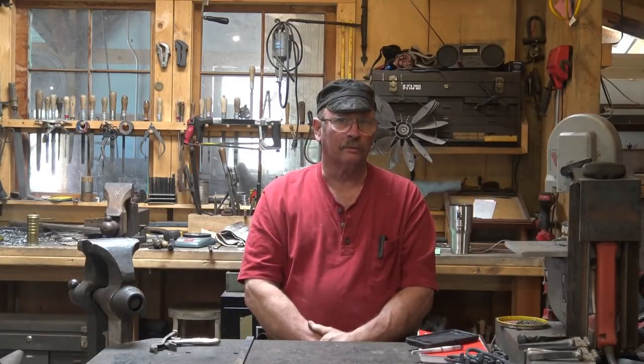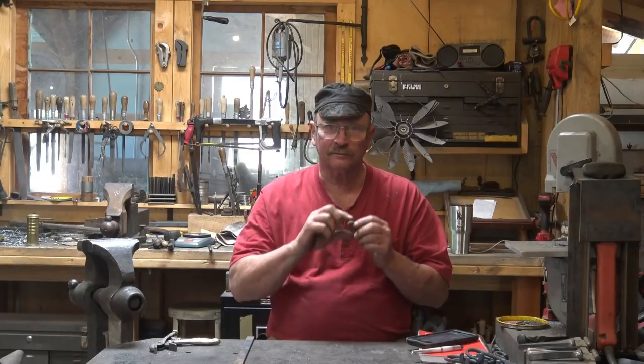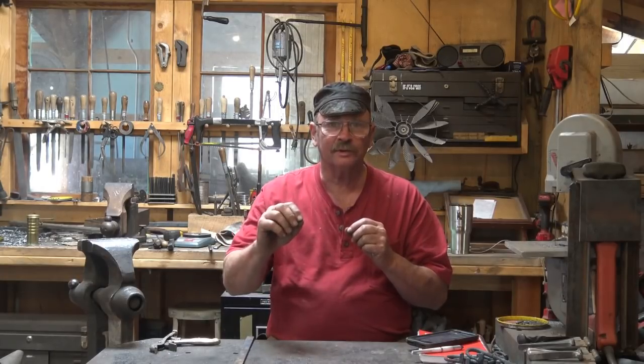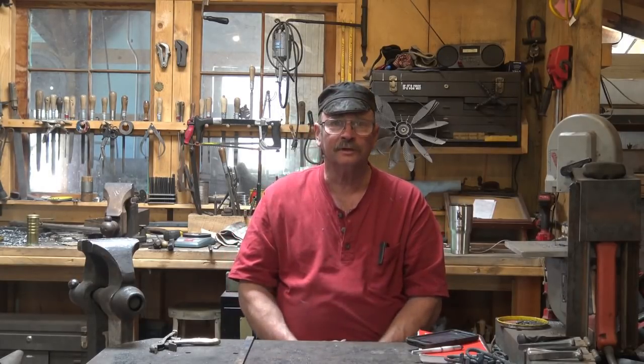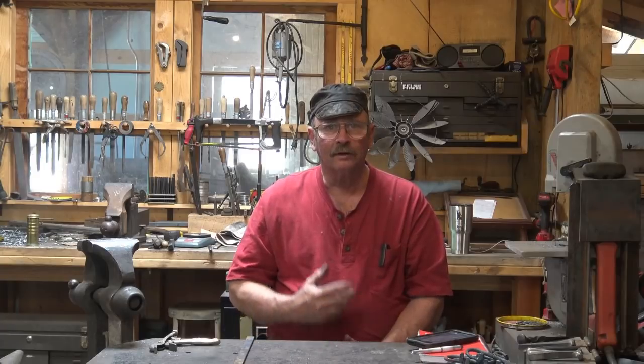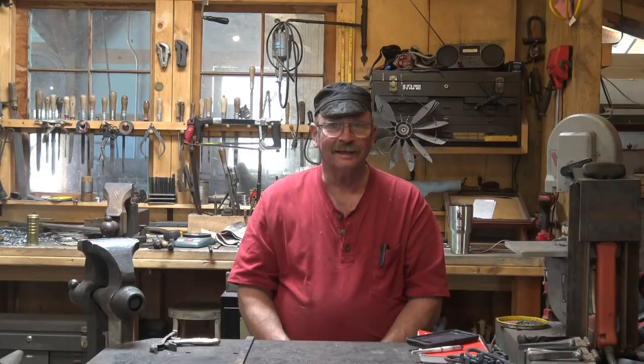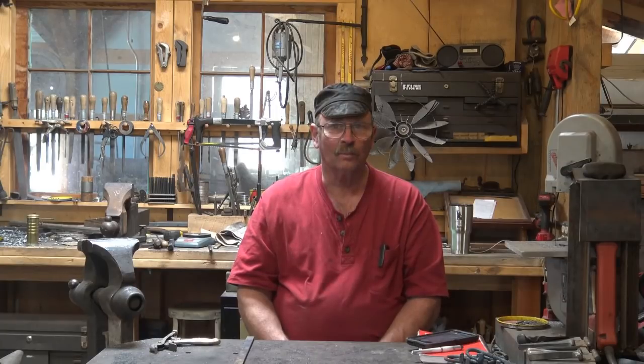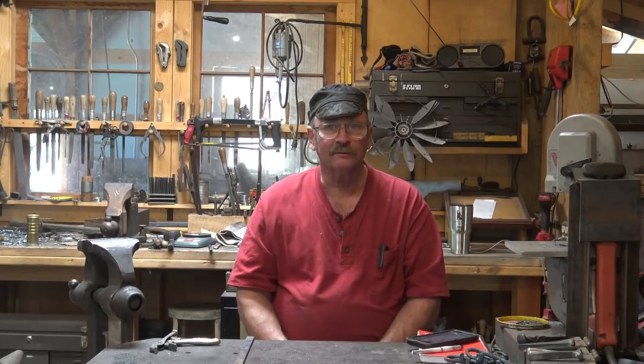When we were working on our window grill project, we looked at forging a simple ribbon scroll — one that just tapered out evenly to the end, doesn't have any special element, it just scrolled up nicely and cleanly. There are lots of other ways you can treat the end of a scroll, and it's usually that end that defines what you call the scroll. Today, I thought we'd look at a nice little scroll called a snub end scroll.